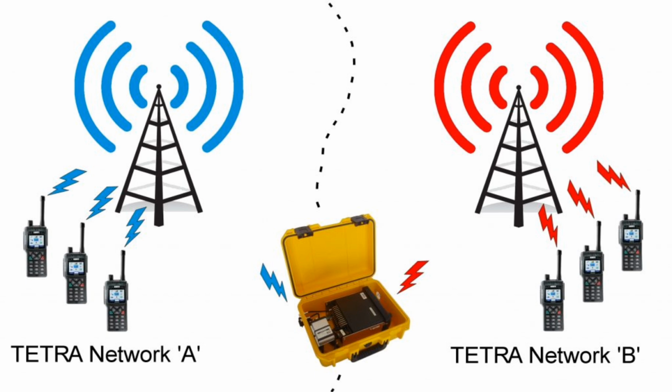Oh, absolutely. Then you have the site controller. That's really the brains of the MTS1. It even has an integrated GPS module inside. And it enables different modes, like BOT1 is just basic startup. Then there's a test application mode, powerful, but you need to be careful. The manual warns about that. And finally, the main site controller application. That's its normal operating mode, handling all the radio traffic.